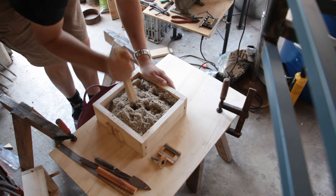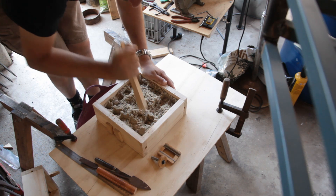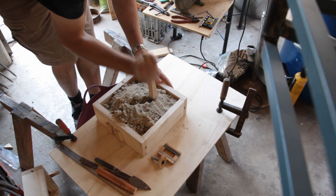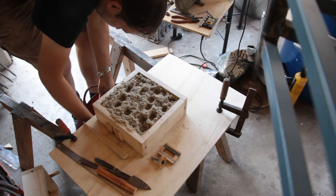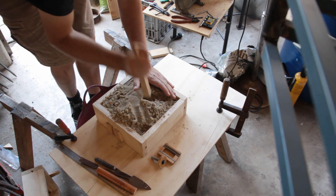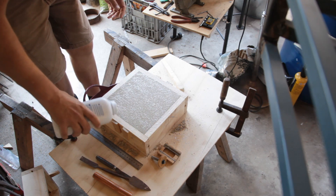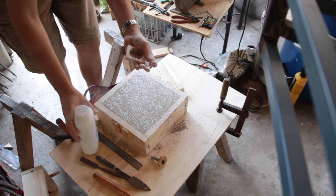Incidentally, this will be the first time this particular batch of sand is used, so it might not be optimized yet. But green sand actually gets better with use — you keep tempering it with the right amount of water, because all this ramming actually drives the clay to be more tightly bound to the sand. My only concern is that the sand might be a touch fine for this particular alloy, so I'll be venting rather generously just to give it the best chance. Talc is a good parting compound — it'll keep the sand from sticking to itself and keep the patterns from sticking to the sand.